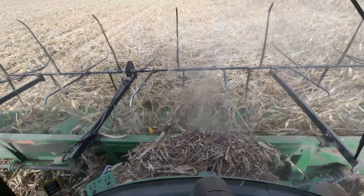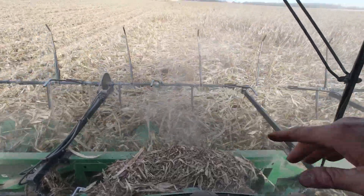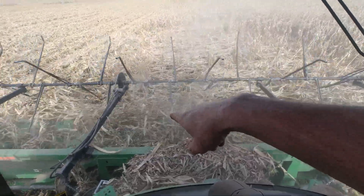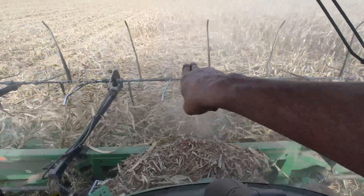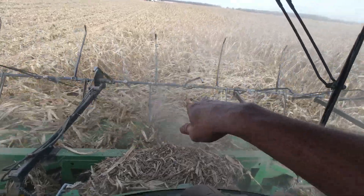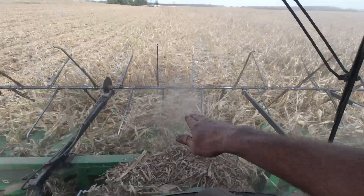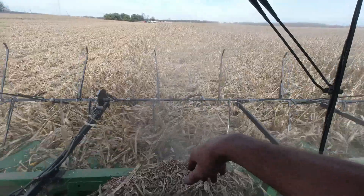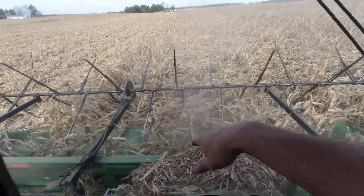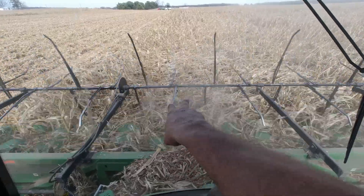As you can tell, going through here it's so flat you can't even see the row. But what we have is row sensors — I call them curb feelers — out on one row out here, and that follows that root ball. We've been in some stuff that's even worse than this where there's nothing standing. So I just run these snouts all the way to the ground, they're just bumping the dirt. You take a chance of folding one under — done that a few times — but we got to get the corn. It just follows that root ball, that stalk. Pretty amazing. You couldn't do it without it.